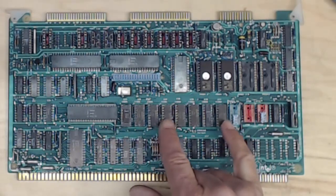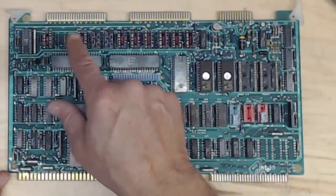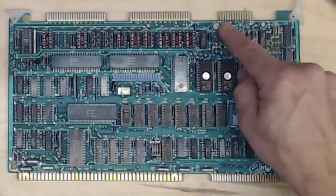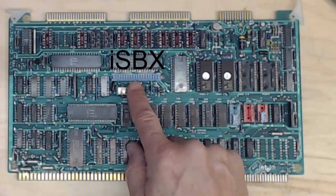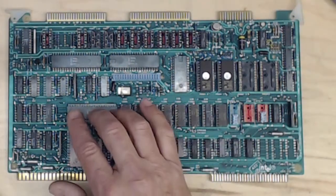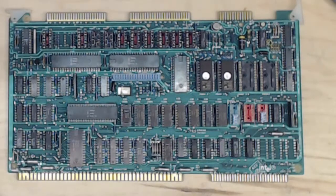We can also have 4K of RAM. While the board originally came from the factory with 1K of RAM, you can expand it up to 4K. In terms of I/O, we still have 48 pins using the two 8255s. We have our 8251 USART and serial port, with drivers for a teletype or a 1488/1489 for RS-232. It has hardware handshaking. We have our full bus down here and our P2, which is still primarily diagnostics. They also added a new connector called the ISBX — the Intel Single Board Computer Bus Expansion.